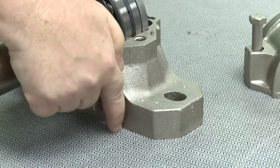So that's centering in the housings and installing on the sleeve, but we have more to go to center the pillow blocks. Normally they would be mounted on a plate, but for this demonstration they're not. We would refer back to the prints for the center position, or the marks that you made during disassembly, and measure to get our center point on our housings. We'd make a mark on both the side and front of the housings. You also want to make sure the housings are properly aligned vertically with the correct shims, and that the housings and bearings are square and perpendicular to the shaft. And then we'd all be centered.